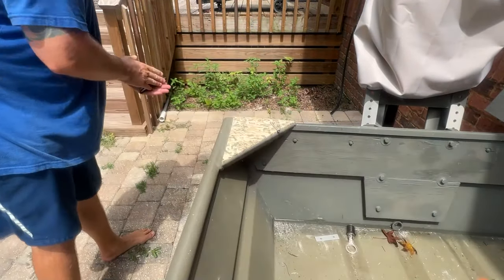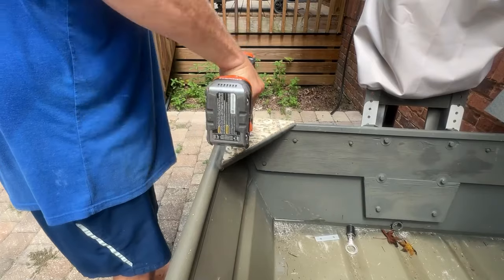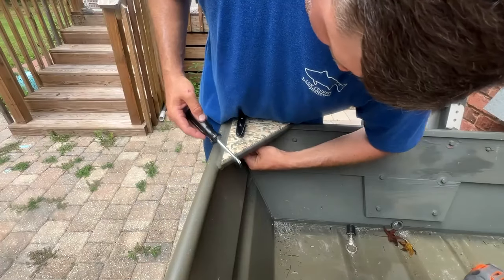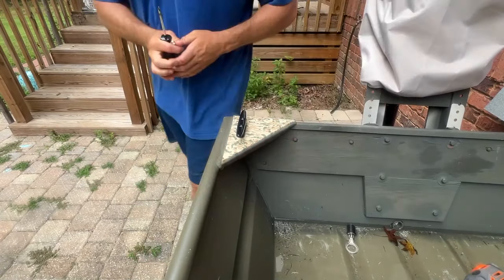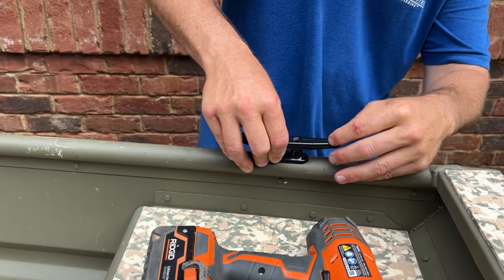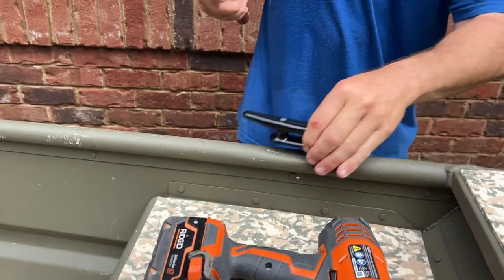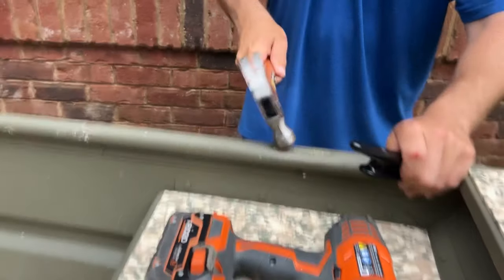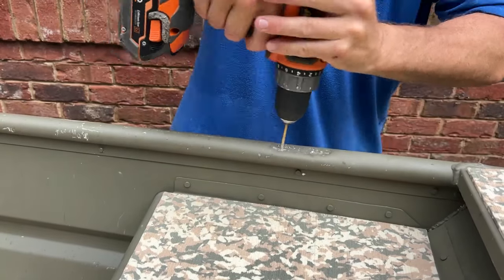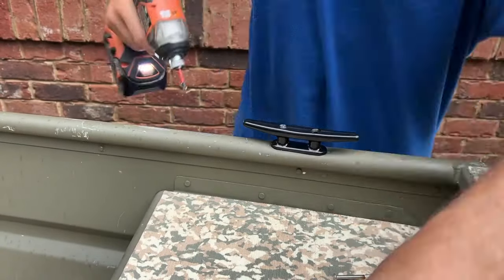Working through the final punch list items: the boat needed cleats on all four corners. In the back it was very simple — I got cleats from Amazon with stainless steel hardware, pre-drilled the holes, set them in place, and bolted them through the back. For the front cleats, I didn't want to use that front horizontal piece; I wanted them linear like the rear ones. To do that I took a hammer and tapped the rounded tubular area to flatten it out, giving a nice flat surface, then drilled a couple of holes and came in with stainless steel screws from the hardware store.